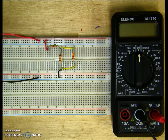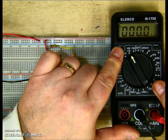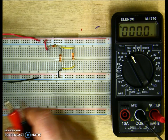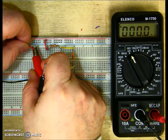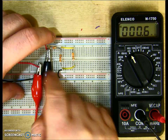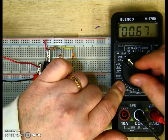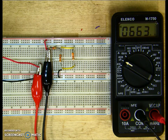Let's finish this circuit with our current measurements. I'll set my meter to 400 milliamps. We're going to take the I total of the circuit, so I'll break the circuit at the power supply, connect my positive lead there, and connect my negative up to the top of R1, since R1 is in series with my voltage source. I get 0.6 milliamps. Turning down to 4,000 microamps, the current total for this circuit is 663 microamps.